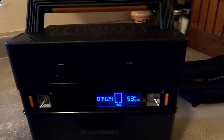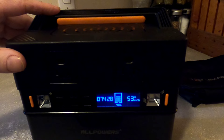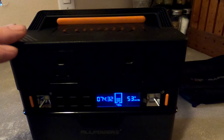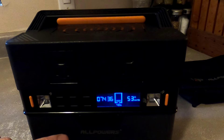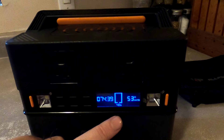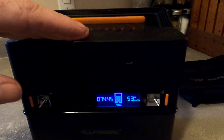When this first arrived it had no power in it at all — from other review videos that seems standard. Charging it from dead to full, I was able to put about 220 watts worth of power into it. Even though it's rated at 288 watts, realistically I found this has closer to about 200 watts worth of usable power output, due to losses from DC-to-AC inverter conversion and screen power consumption.